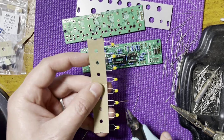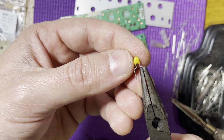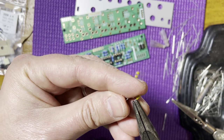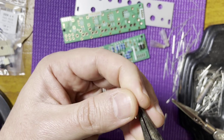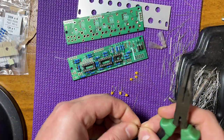Next came the film capacitors. These are not polarized. The 100N caps in the kit have their leads open too wide for the PCB, so I used my pliers to straighten out all of the leads before proceeding with plugging them all in, soldering and trimming the leads.